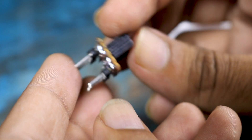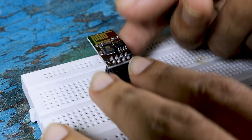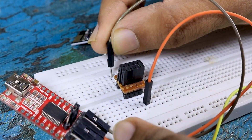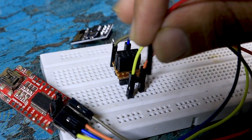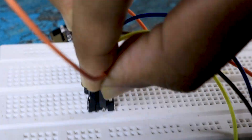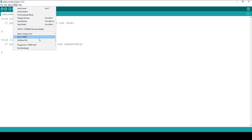Before we can start programming, you will need to make an adapter board since the pins on the ESP01 module are not breadboard friendly. Once you have your module on a breadboard, first remove the ESP01 from the breakout board. Connect VCC and ground to 3.3V and ground. Now connect TX of ESP01 to RX of FTDI and RX of ESP01 to TX of FTDI. Connect the chip enable pin to 3.3V, and to put the ESP01 into programming mode, connect GPIO0 to ground. After connecting the USB cable to your FTDI, open Arduino IDE and select the port of your FTDI.